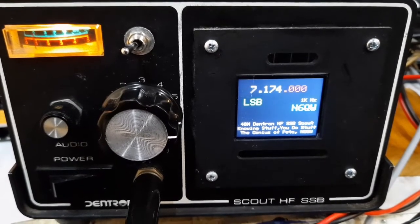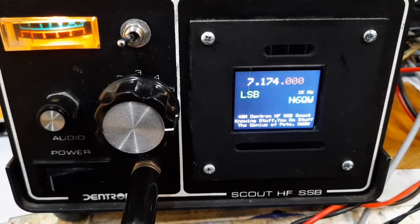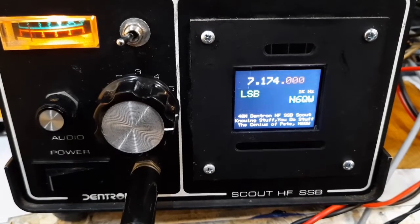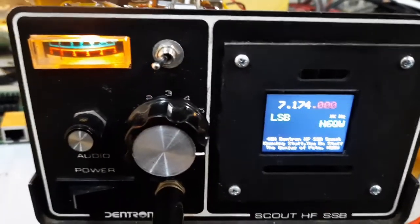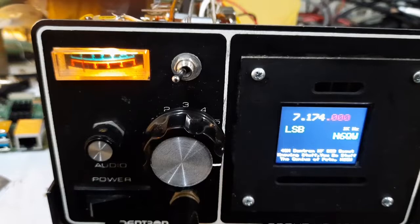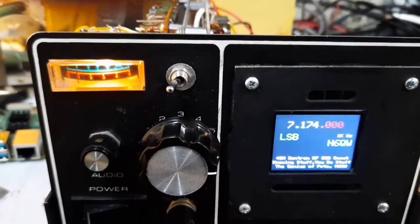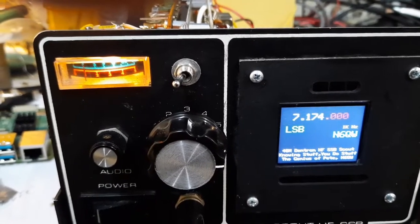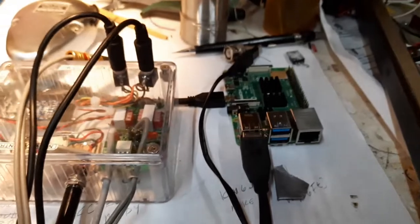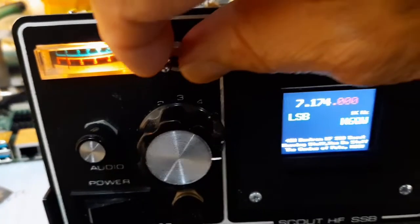It works. You turn it on, it works fine. All the functions work. You turn the VFO, and more than likely you'll hear did-a-da, did-did UL, which means unlock. The PLL comes out of lock. It's still lit up and all that, but the receiver is out across the range. You have to turn the radio off, turn it back on, and it works fine again. So you move the VFO. So that's the problem with this run of the 2000.